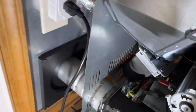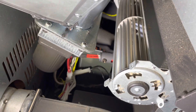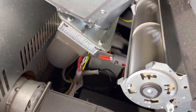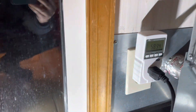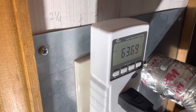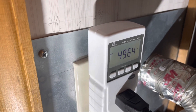When the exhaust thermostat reaches the right temperature indicating the stove is at hot operating temperature, this scroll blower right here will turn on — and there it goes, it just started! That's now blowing warm air out the front of the stove. And at that same moment, back here on the meter, we're now down to only 55, 63, 48 watts — settling around 47 watts or so.